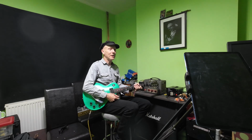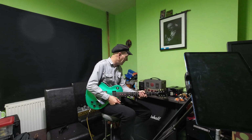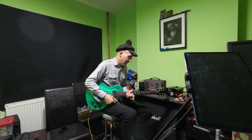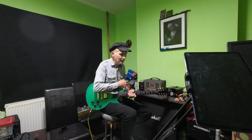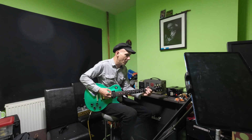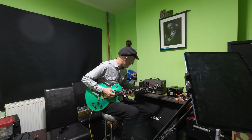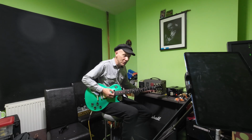Now you won't get a great overdrive sound out of this amp, and the customer doesn't really want that, so he'll probably never crank the volume up to number 10. This amp is so loud, you can virtually get whatever drive you want out of it, but the coupling caps are a bit high. So it's a little bit grungy on the bottom end. But the customer doesn't go for that sort of thing on this. He's a traditional blues player.